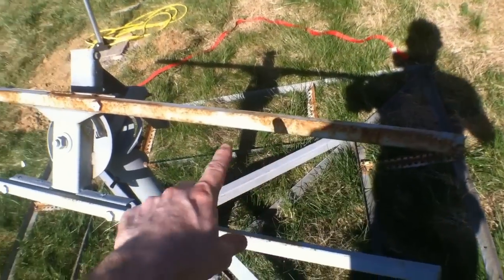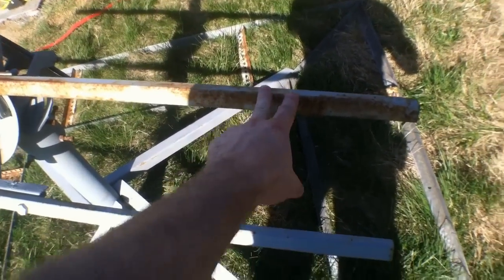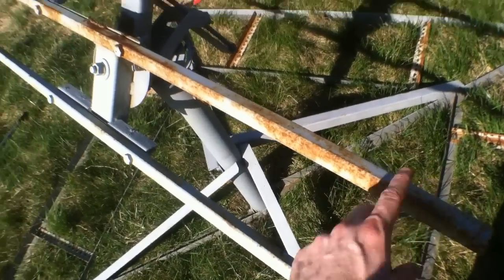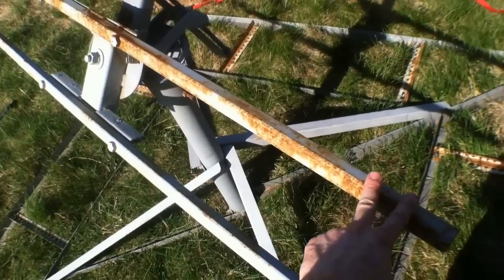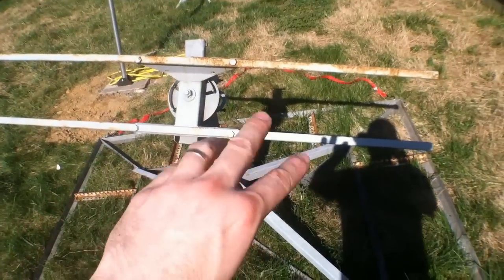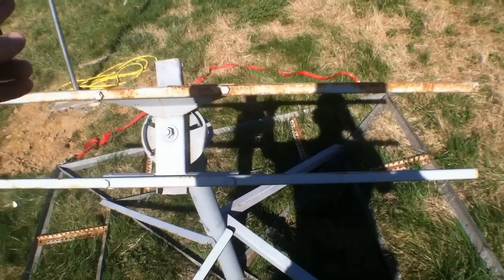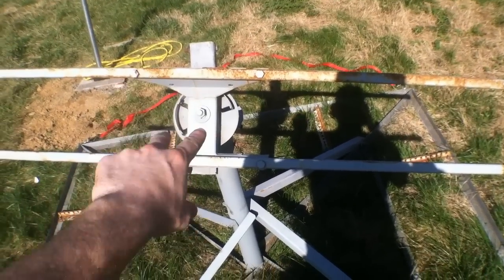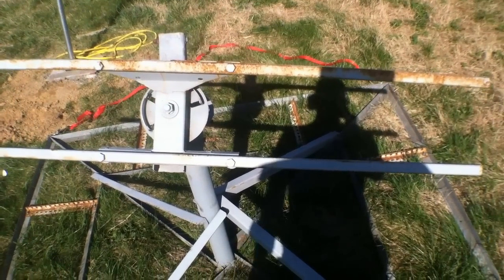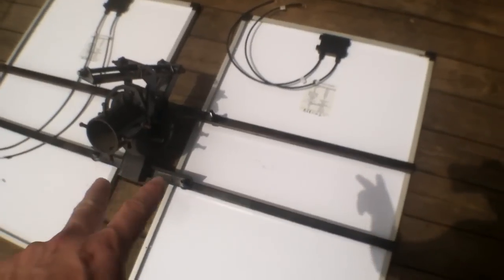Once the mount is finished, use solar channel or tubing to build your racking. I had one-inch tubing and recycled it rather than buying solar channel. If you have channel, you can bolt it right to your equatorial mount. Don't put so much channel that you hold more than three panels — otherwise you'll create a sail in the wind. My panel ends here and the other ends there, leaving room to easily adjust the angle.